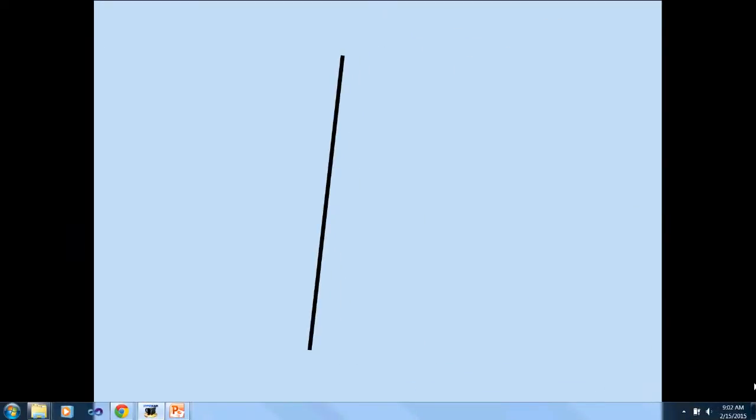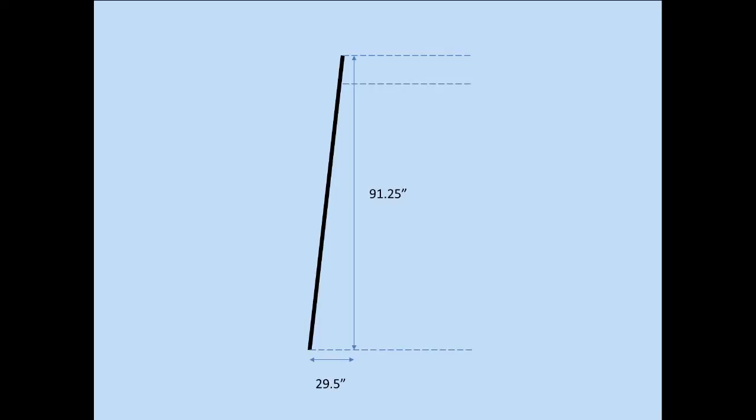The project for today is building a loft ladder for the loft I just built in the mini barn. If you don't like math, just bear with me, because I'm not going to use math, but I'll go real quick how you could. What I did is I laid a ladder up at the angle I wanted, and I took the rise over run: 91.25 over 29.5. If we were using math, we'd want to know the length of that slanted line — the hypotenuse. Pythagoras came up with the Pythagorean Theorem, which states the square of the hypotenuse equals the sum of the squares of the two remaining sides. So if we take the rise squared plus the run squared and take the square root of that, we get the actual length, which is 95.9 — that's the inside cut at the bottom of the floor.